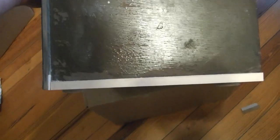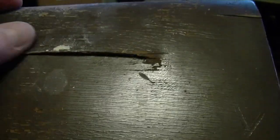I finished installing a new piece of trim on one side, going around the front edge and repairing missing layers of lamination as needed. Really, all that's left in terms of repairing the cabinet is dealing with this split. So as I was saying earlier, I'm going to try to steam it and clamp it down and see if I can get that back into shape.